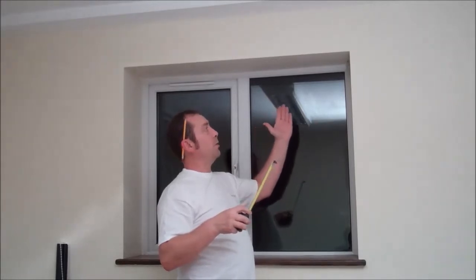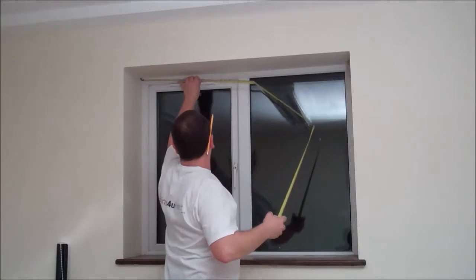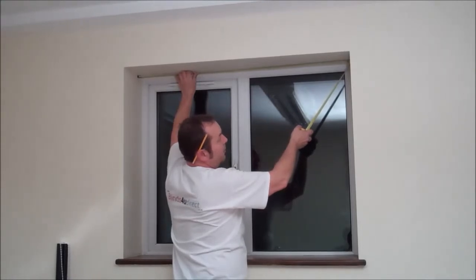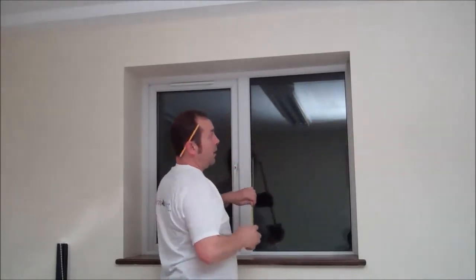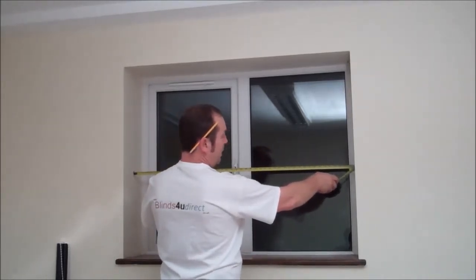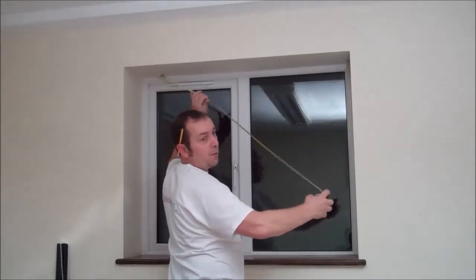So our roller blind, if we want to come from the window frame, say 60mm or 6cm — just see where 6cm is and then measure at the top the width. This needs to be reasonably accurate and needs to be given as a recess size so that we can make deductions for the brackets and so forth to actually fit in there. You don't need to make adjustments unless your windows are well out — just check the other measurements. And as long as it's within like 10 or 15mm, take your top measurement as being the gospel for roller blinds.